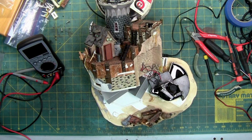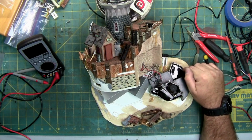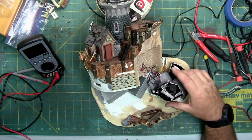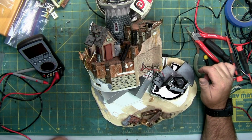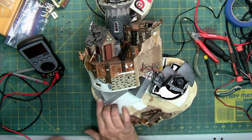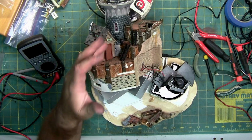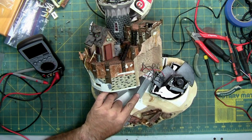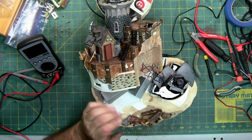And then maybe I can trace it back to find out why I'm getting no power to the fogger. Although I am getting continuity through the water, and with the two probes. Something's not reading, and I think there's some wire somewhere in this cluster in this corner, if you remember when I picked it up, that is broke, sheared, or arcing, causing a problem. Because it's a 4.5 volt unit, I get 3 to 3.5 volts of power, but when I touch these two brackets together, which are actually connected with a wire, so that means the wire is probably bad, I get 4.5 volts of power and everything speeds up.